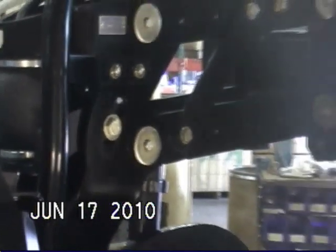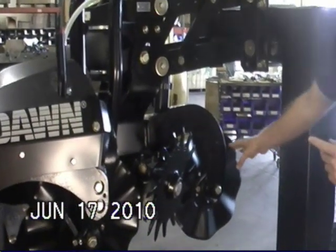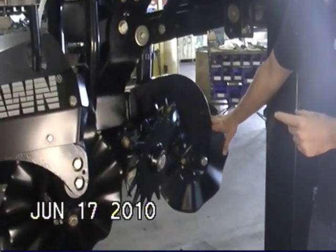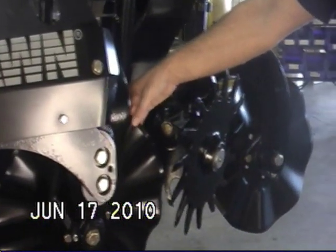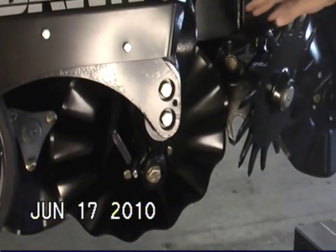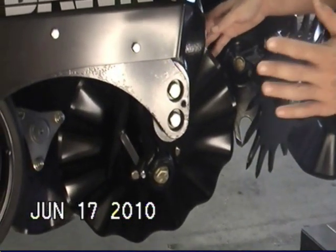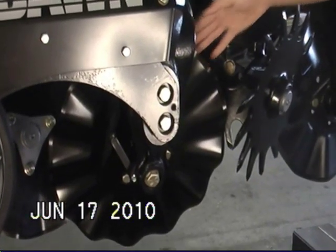In the front of the unit we have the leading coulter. There are three coulter blades on the unit. The front blade is a 16 inch blade and runs straight up and down. The rear two blades run at angles — the middle blade is an 18 inch blade running at a slight compound angle, and the rear blade is a 16 inch blade also running at a compound angle.